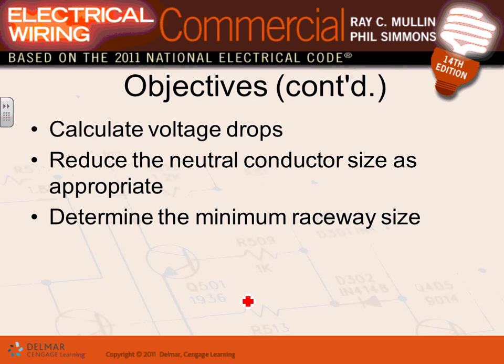There's something called the voltage drop problem, guys, in feeders. The most important thing that could force you to go to a higher size conductor is the problem of voltage drop. Feeders tend to be 50, 100, 200 feet away from the source. With this, guys, you get a voltage drop problem. So we'll talk a little bit about that one.